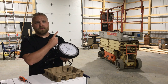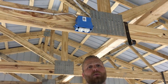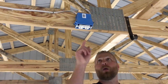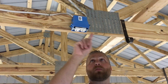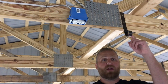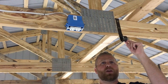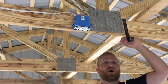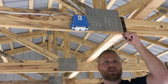We're going to jump on our scissor lift and get this hung from the rafters like we did the other four earlier today. I've recruited my son — he's on the camera, so I apologize if it's a little shaky. We've got all eight of our 110 plugs installed into the ceiling as the power supply for our lights. We've also got hangers we made yesterday — one inch wide, eighth inch thick by 15 inches long, with a U bent over the top to go up and over so they're nice and secure, and a small loop with a bolt to keep everything tight once hung.